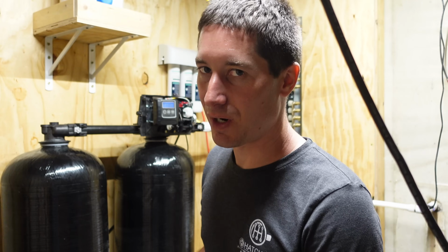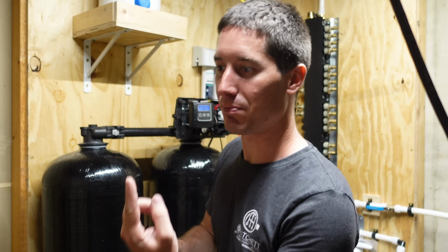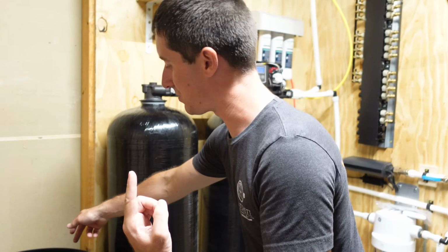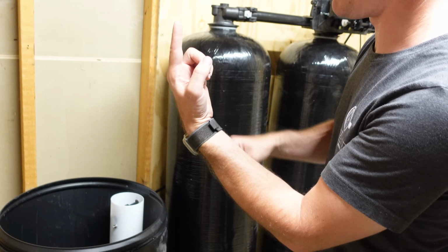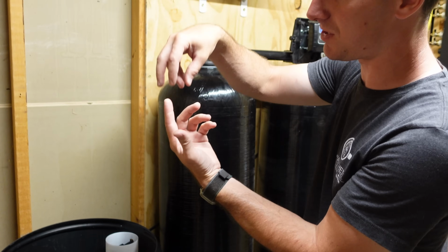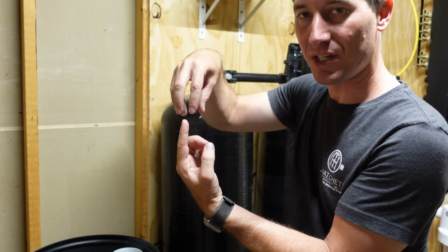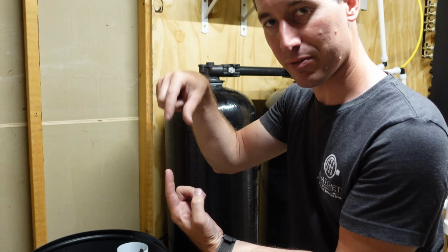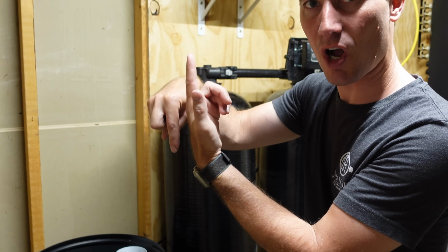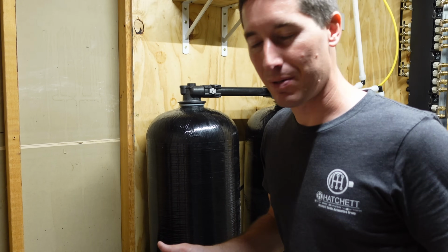Well, the brine tank was too, what I found out after I took everything apart is there's a plunger in there. The plunger connects to the safety float. The safety float's down here in the tube, right? And that plunger has a dome over it, and then this connector on top is a quick release, and it holds all that together. Well, I think that plunger regulates the flow of water into the brine tank. It had gotten stuck underneath the safety because it's like a rocker system. Crazy. But it's all super simple.